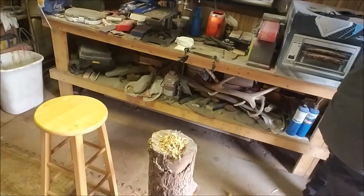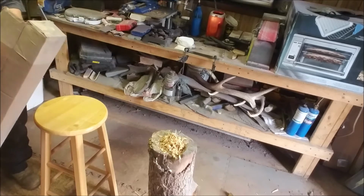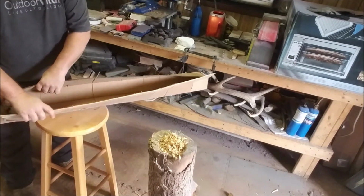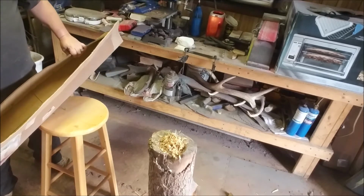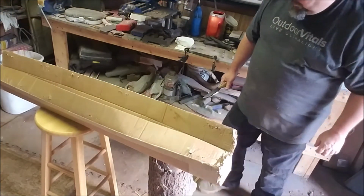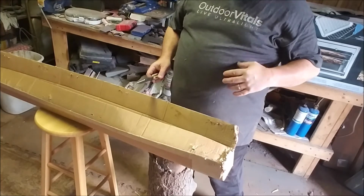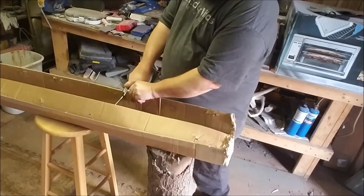This cardboard that I have is covered in steel dust from these grinders, and it just permeates the pores. These boxes are what I get my steel shipped in. I'm gonna make 20 or so cuts on this. I use a lot of 1095 steel and 1080 steel. I use 15N20, and especially when I'm making pattern welded Damascus stuff, I use the 15N20. Alright. Again, this cardboard is permeated with steel dust.